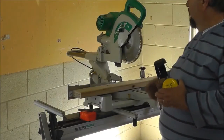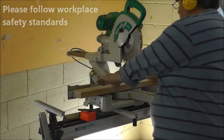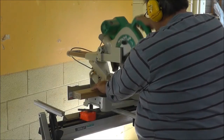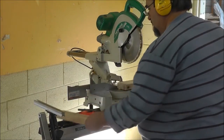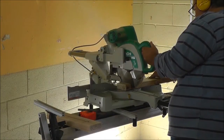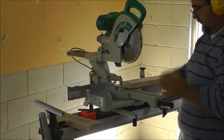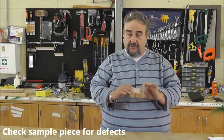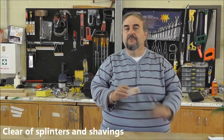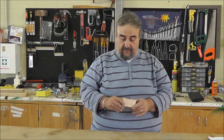We cut that out using this drop saw. Please remember to use all relevant workplace safety. After cutting our sample piece, we make sure it's nice and solid. Take off any small shreds or shavings from the side of it, because one or two grams will affect the variance in your readings. So take off anything that might come off during the drying process. This block is now ready to weigh.